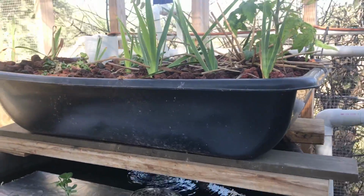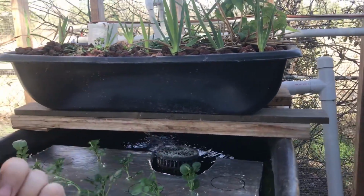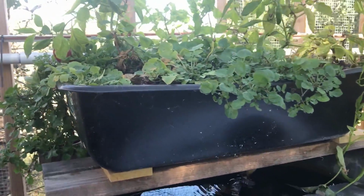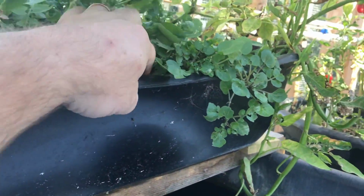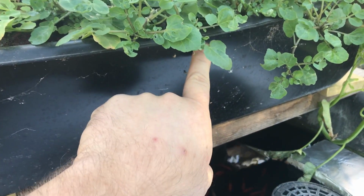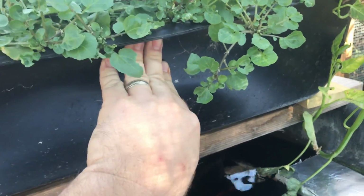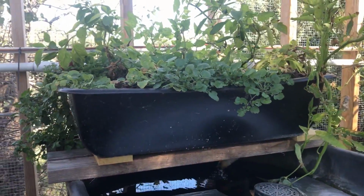So I'm going to use all the 21-gallon ones from now on, with the modification that wherever they go, they will be supported long ways, which makes perfect sense when you think about it. And the other modification we're going to do is drill a hole right there, and on the other side we're going to put a piece of all thread with some fender washers across the center and make a center brace that pulls that together. And once we do that, we should be golden. We shouldn't have any more problems with deformities on them at all.